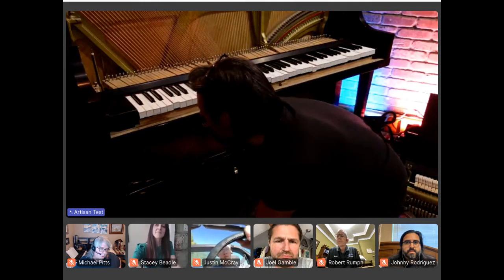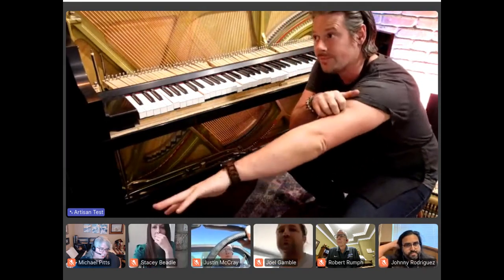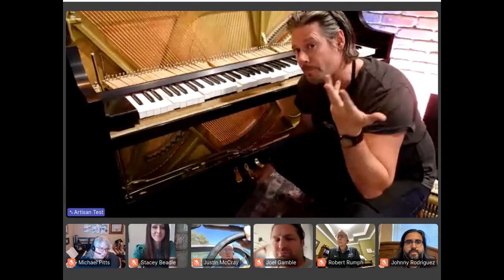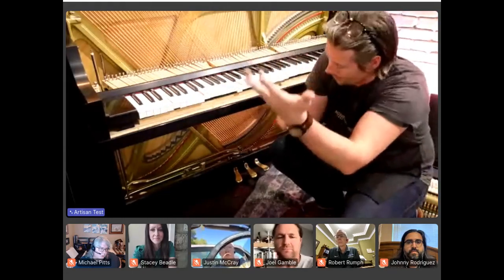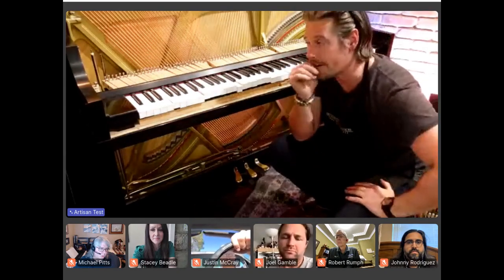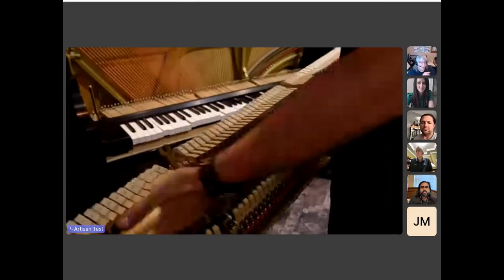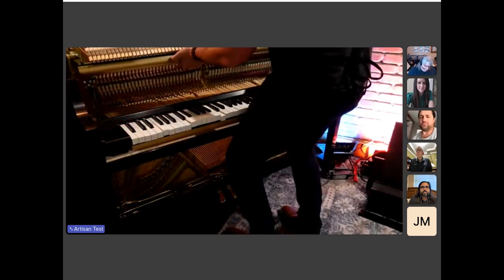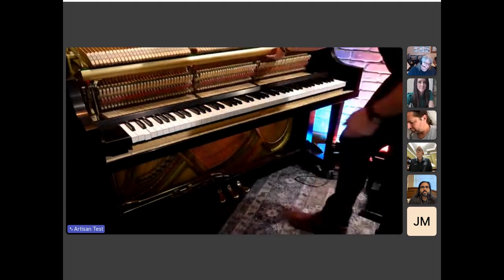that looks right. So I've gone ahead and set the pedal rods where I know they go on their coinciding assemblies. The middle pedal in this case is a bass damper lift, so I know that that's going to go on that side and to the right side, and then my full damper lift is going to be on that far left side, so I'm all good to go there. So what I'm going to do, again, holding the action about shoulder length apart, typically what I do with these is I will just go ahead and set this on the pivot points first.